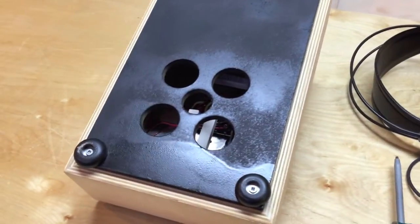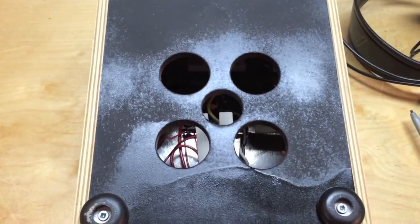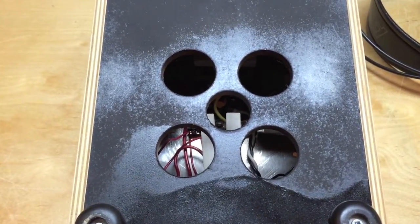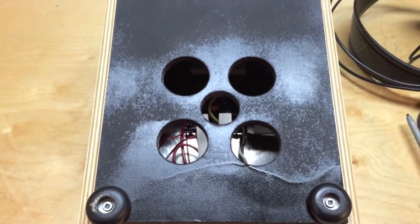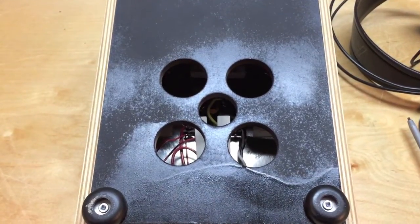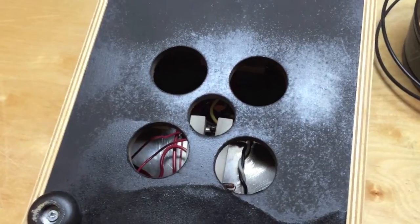Here's the underside of it. You can see the large holes I've created in the bottom. The bias resistors — the cathode resistors — actually get really hot and are very large; they dissipate a lot of heat. So to increase the life of the circuitry itself, I included some large ventilation holes on the bottom.